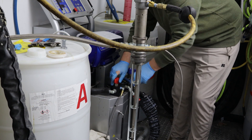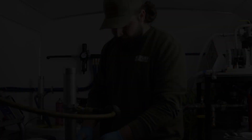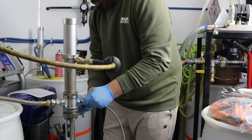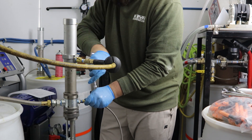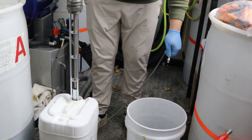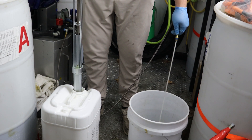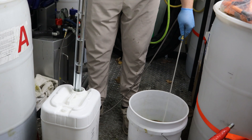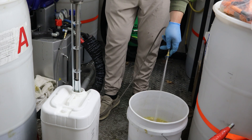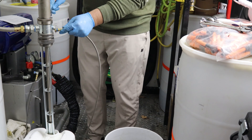Place this in the recirc. Now I'm going to disconnect my recirc line here, just like we did earlier for the flushing side. I'm going to place our handle back into the recirc position. I'm going to actually lift it out of here and pump two strokes of just air. Now when I put it back in here, once I hit that air pocket, I'll know that I've reached the point of just plasticizer — just two clear liquids. There's my air pocket and now I'm back to my fluid, so I can turn it off. Now that I've finished with that, I'm going to reattach my recirc line.